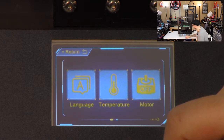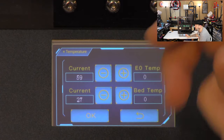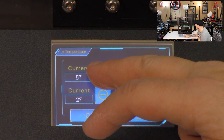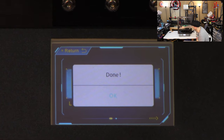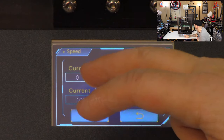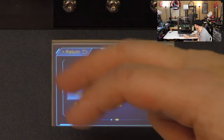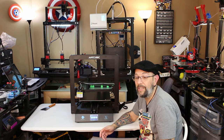There's one more page — there's a Help section; I can't actually read that because I'm old. And the About section has all the firmware information, size, nozzle size, everything. Then in Setup, the middle one, you can change your language between English and Chinese just by tapping it. You can set a specific temperature. You can disable the motors so they're free to move. There's a speed page — the current speed and you can speed it up or slow it down. And the best part: you can mute it. I love the sounds but it gets old really fast. That's the entire menu, really easy to use.